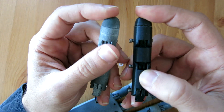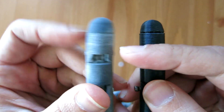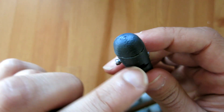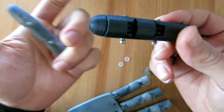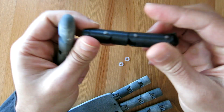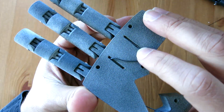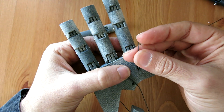Here I'm comparing this finger to a previous one that I FDM printed, and you can see the quality at the interface between two parts is a lot better. On the FDM printed part you can clearly see the lines from the layering process, but in the SLS printed part it's slightly rough yet the quality feels a lot better. Because powder printed parts don't require support material, it allows you to create intricate and fine details and features that still come out neat and smooth.